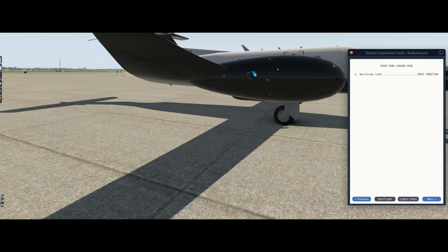And when they do maintenance on the antenna, if they reinstall this backward, which I have actually heard of happening, the drain hole will be on the top, and the drain hole becomes a rain hole. And if you fly through any rain, you're just filling up the radome with rainwater, and it doesn't have any way to get out, and that's a good way to ruin your weather radar.